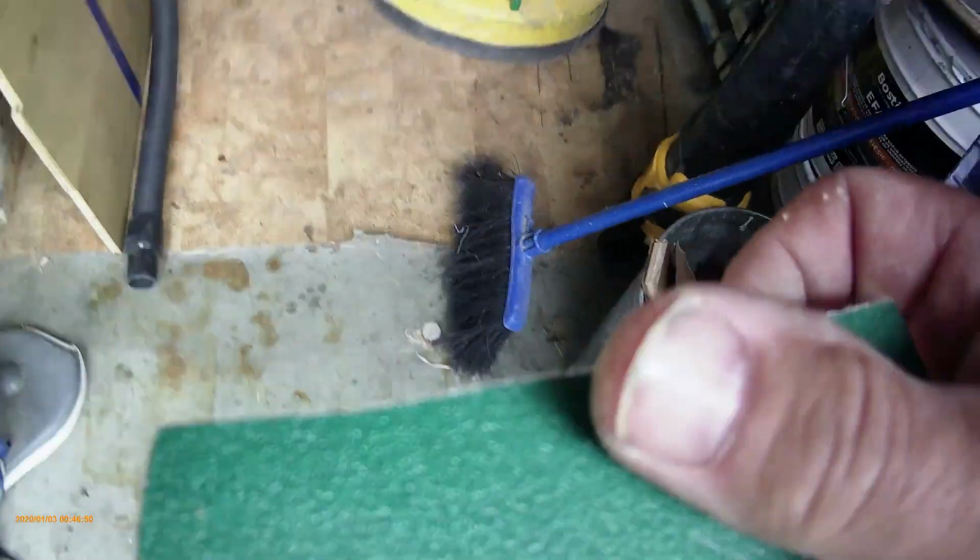The finer you sand the wood, the less color penetration you have. So as long as you keep it open, it'll take and it'll stain okay. It'll usually match your stain fan. I can't tell you how many people pick a color based on a stain fan, and they go out and do the floor, and it doesn't look anything close to it. And it's all about the sanding process. That's why before we got picky with floors, old timers would just sand a floor to 60 grit, hand sand the edges with the wood, and stain it.